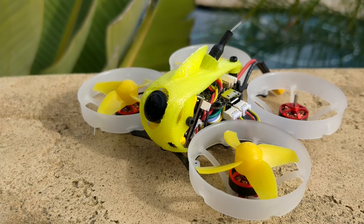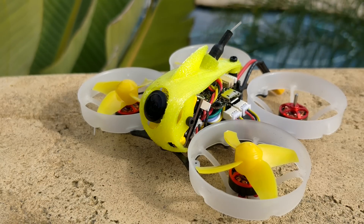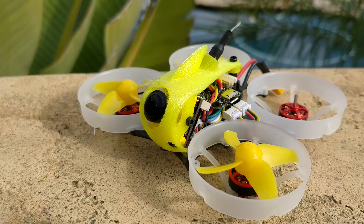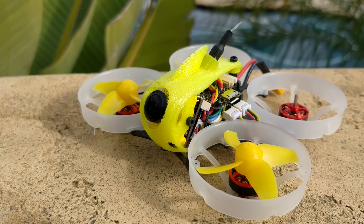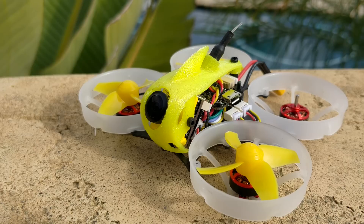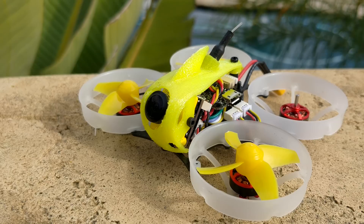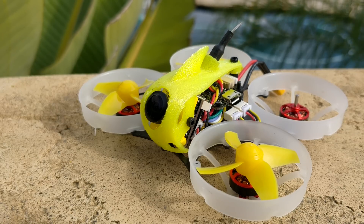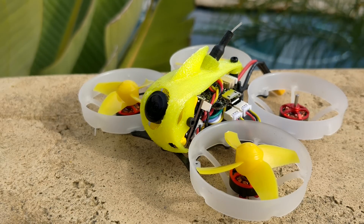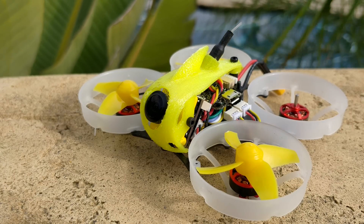Even on my 3S 550mAh battery I only got about three minutes of flight time, which is a little confusing for a battery of that size on something this small. This is also an F4 board, not F3, so it does have the ability to run 8K/8K, but it comes set to 8K/4K by default. I'm just totally confused at why these companies go through the effort of setting up firmware but don't actually set it up — they just put a dummy tune on it and leave it.